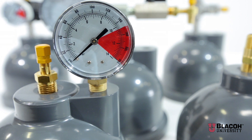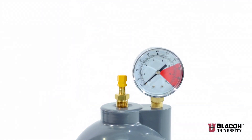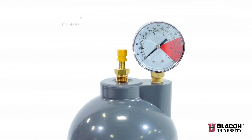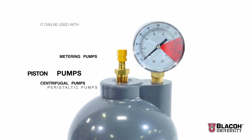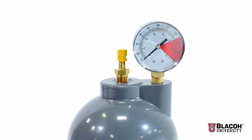This model is used for water hammer conditions where valves close quickly and pressure spikes occur, which can be several times the flowing pressure. It's used with metering pumps, peristaltic pumps, piston pumps, and with centrifugal pumps where startup or shutdown situations can create a large surge in pressure.